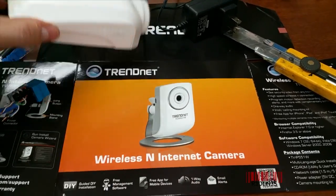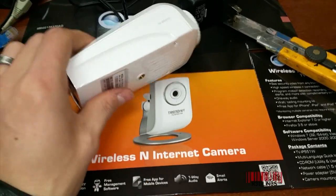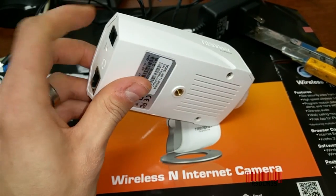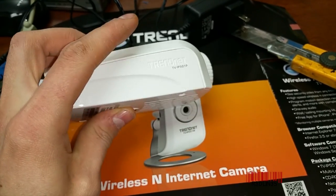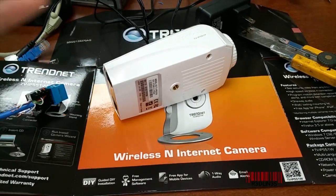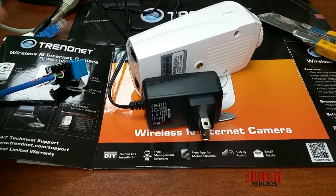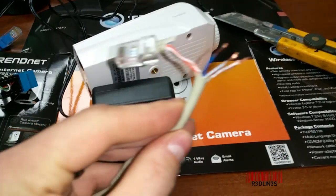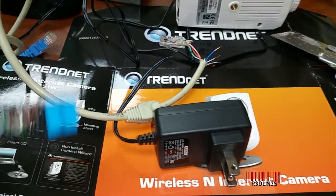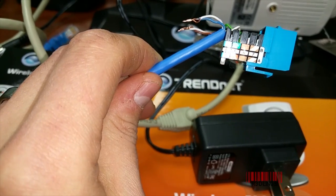For this example I'm using a camera, which is what most Power over Ethernet needs are for anyway. This particular camera does actually support PoE, but I attempted to run PoE on it with my own home setup and you need a 48-volt power converter, which nobody has. So I figured out how to do it without any of that. Everything that comes in the box with the camera you can use to do Power over Ethernet. The key point is you need your power supply, your Ethernet cable, and preferably a connector, though that's not strictly necessary.